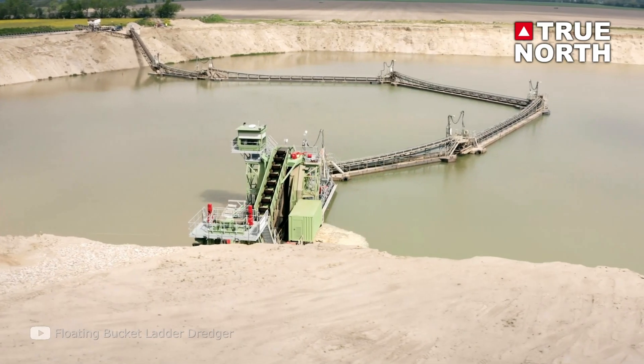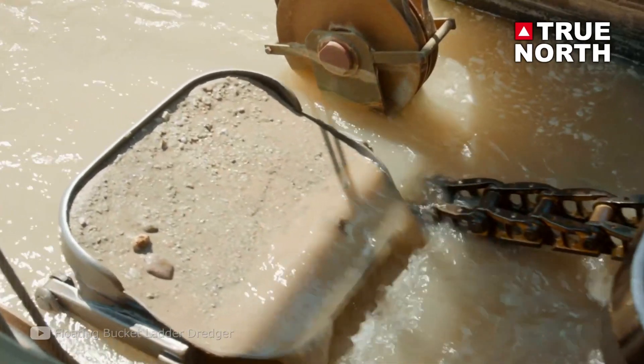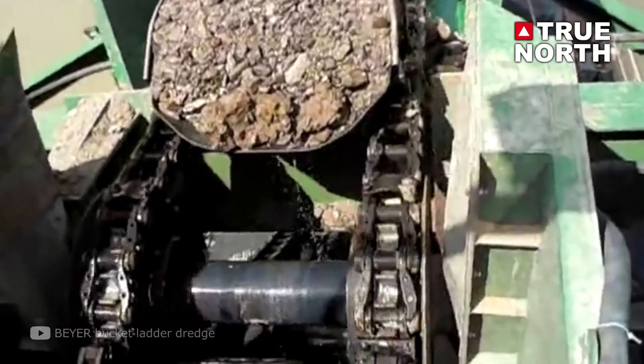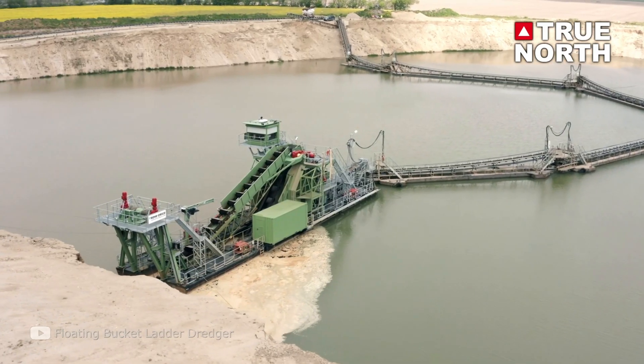Let me dive deeper into how many types of scoop dredges there are. The first is the bucket dredge. This type of dredge has many buckets that travel along a boom on cables. The boom is maneuvered underwater, so the buckets take a scoop of sediment and travel back to the vessel or barge where they deposit their load. Bucket dredges are able to pick up large rocks and sand. Teeth are placed at the openings of the buckets and dig deeply into the material. This type of dredge is best for long distances like harbor approaches.